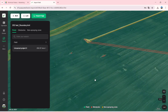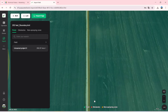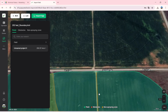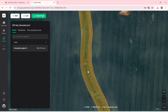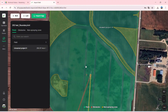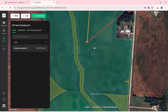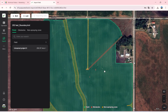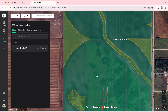You can see we have our obstacles here, we have our pivot, and our no-spray right here. It's slightly off on the satellite map, but you can see where the no-spray was drawn — it's fairly accurate. It's got our ditch in here — the drone will fly over these areas but won't actually spray onto them, which is very nice. Once you want to import this onto the app on the controller or phone, click Import to App and it is now on the app. Then go into the app, click on it, hit Start Operation, set your parameters, and away you go — simple as that. Thanks for watching.